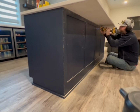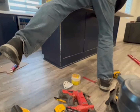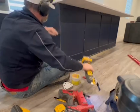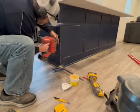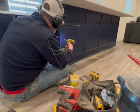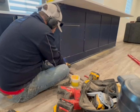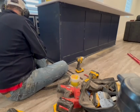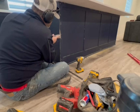Once the relief cut has been made, I can already tell that the panel moves back into its original position with no resistance. I did not want to take the panel completely off as the opposite end mitered edge held really nice. So I'll shoot some Power Grab adhesive into the gap and along the mitered edge, add some screws, and clamp it. Now, I'd normally not use screws on a project like this, but I want to make sure that it's secure and stays put. I already have to do some puttying anyway, so I'm not really concerned about the extra effort of making those look nice.